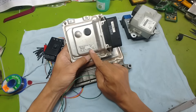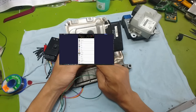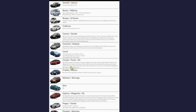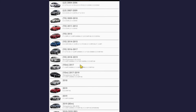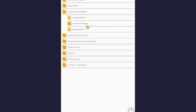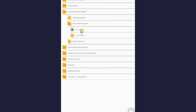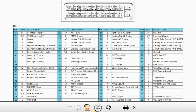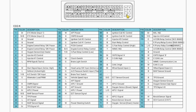Today I will use the wiring diagram from a Kia vehicle as our example. First, open your wiring diagram software. Select the brand Kia, then choose the correct vehicle model and year of production. After that go to the section called engine electrical system and then choose MFI control system. This ECU runs a 1.6 liter gasoline engine, type G 1.6 DOHC. Now let's take a look at the first page of the wiring diagram. Here you can clearly see the shape and layout of the ECU connector pins. Compare it with your actual ECU connector — if it matches then that means we are looking at the correct diagram. On this page the pinout of each ECU pin is also clearly labeled so you can easily identify the power pins and the ground pins.